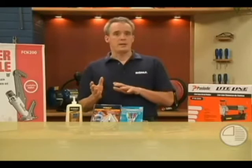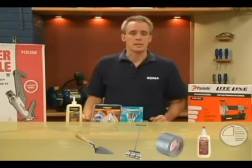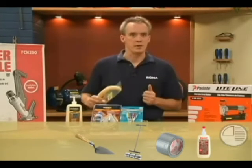If you're going the glue route, add a trowel, a 100-pound roller, duct tape, and the appropriate glue to your kit. Now remember, applying glue will erode the trowel's teeth, so you have to figure on a new trowel every 400 square feet.